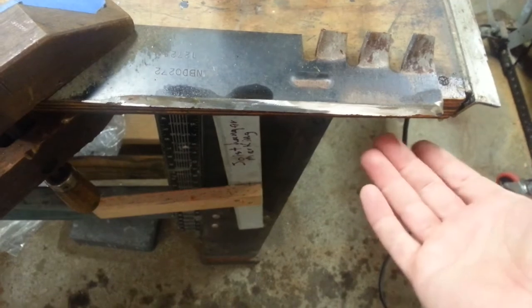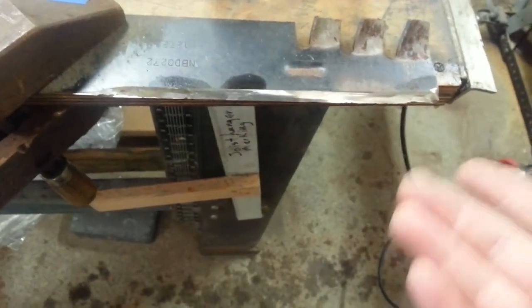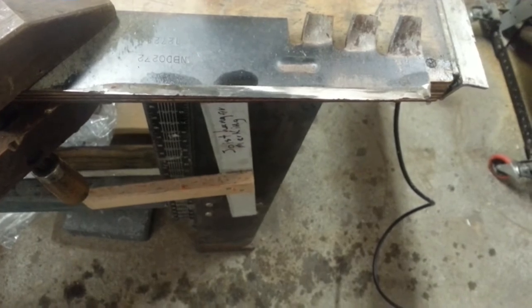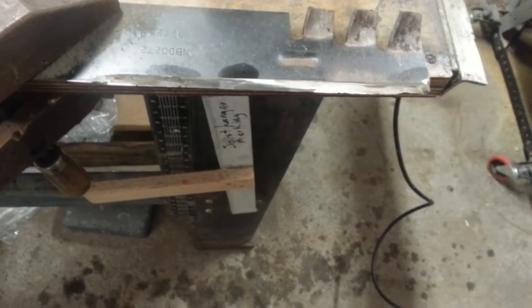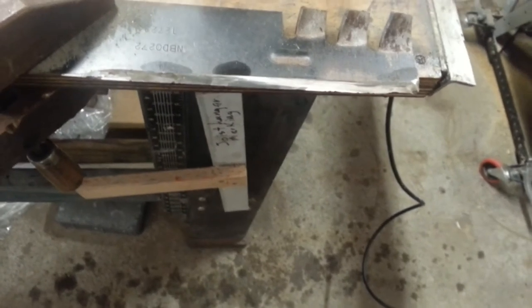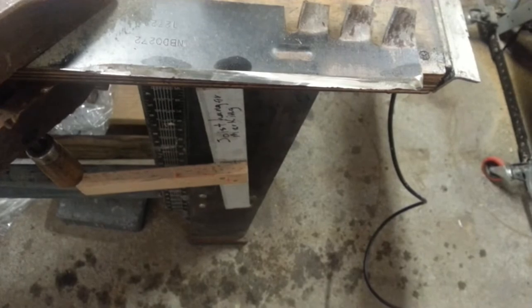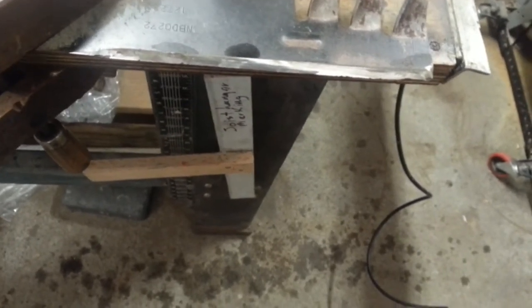Another point: when you grind the backside, remember the backside of these is flat. You don't want to cut it into a knife edge, because then the grass isn't going to be ejecting properly. If you cut it half and half, grass could just as well go down as go up and out the hopper. That's just a little tip on that.